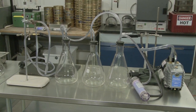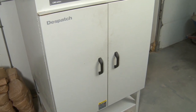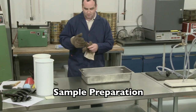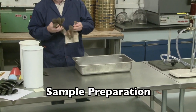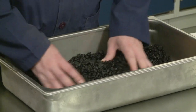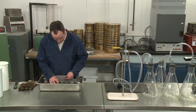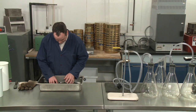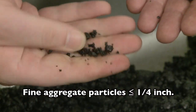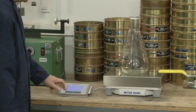For laboratory prepared specimens, condition the sample for a minimum of 2 hours at 275 plus or minus 9 degrees. For plant mix specimens, dry to a constant mass at 221 plus or minus 9 degrees. Let the sample cool until it can be safely handled, yet is still warm enough to allow particle separation without fracturing the aggregate. Separate the particles by hand. The fine aggregate portion of the mix should be reduced to not more than a quarter of an inch. Allow the sample to cool to room temperature.